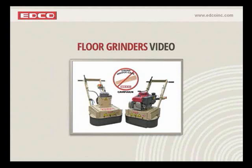For those of you who are mechanically inclined out there, that locking mechanism has a cable. There are many different adjustments that you can make to that. There's a lot of play in it. As it loosens in the field, the first adjustment you're going to make is right up on the handle, and there's a tremendous amount of adjustment to keep that tight. And then there's a lot of adjustment down in the bottom, and easy to access, easy to maintain beyond that. So let's move on here to the next slide.